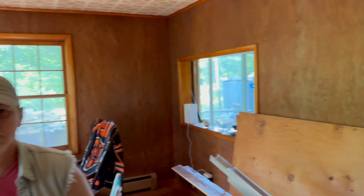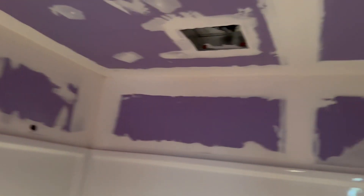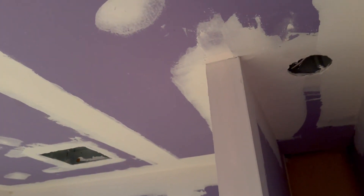While she's doing that I'll get some more going. Let me show you what I did yesterday — I was pretty much just doing this myself because there's only room for one person. We've got a ramp all set up, a plank, all the taping done, all the corners everything. Look at that — done all yesterday! Maybe today I'll do some time-lapse or demonstration videos on how to apply the second coat. All the tape is bedded and everything. I got these outside corners — these are mud-in outside corners. You mud them and you don't fasten them with screws or nails or anything.